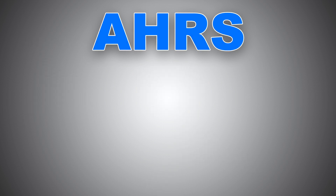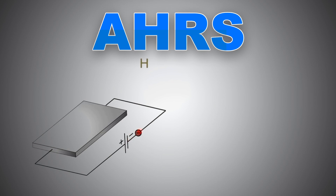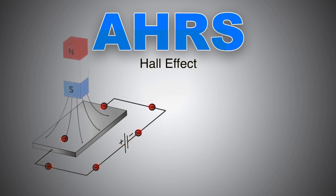And last but not least, magnetometers — three of them again. These sense the earth's magnetic field, or flux. They do that by Hall effect or magnetoresistive effect. Most IMU magnetometers work on the principle of Hall effect. The flux is used to determine your magnetic heading, as seen on the PFD, based off the track.